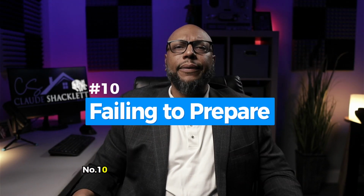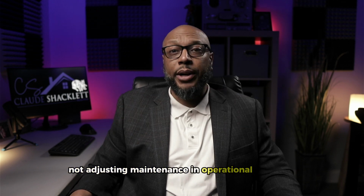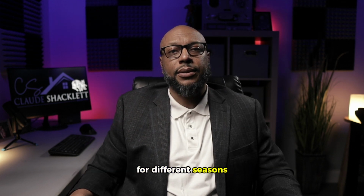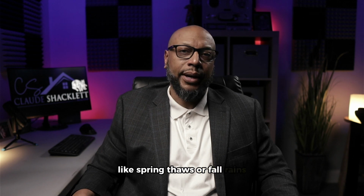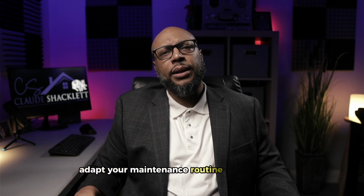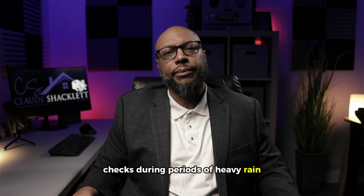Number 10, failing to prepare for seasonal changes. Not adjusting maintenance and operational practices for different seasons. Increased risk of failure when the pump is most needed, like spring thaws or fall rains. Adapt your maintenance routine to the season, such as more frequent checks during periods of heavy rain.